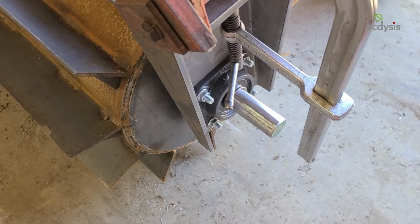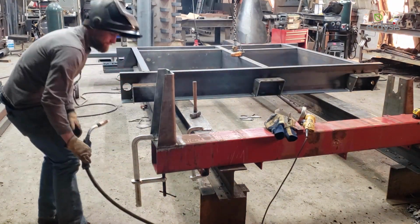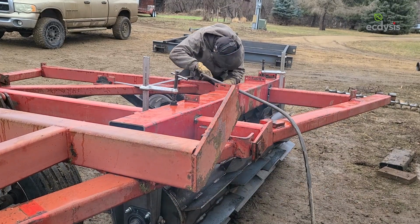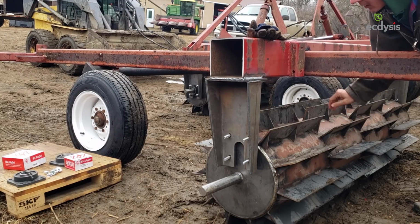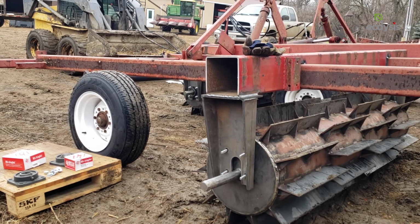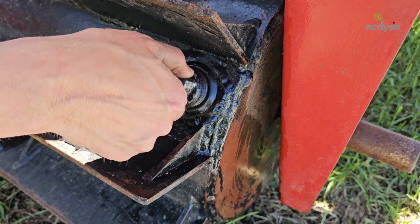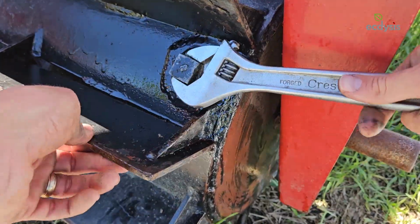We did one final check that the bracket and drum did not interfere with the arch of the road tires by clamping the bracket to the toolbar and taping the cardboard drum template to the bracket. If everything looks good, weld the brackets to the yoke, and the yoke into place onto the frame. The only thing left to do is maneuver the drums into the brackets and attach them to the brackets with bearings. This can be done in a similar fashion to how the center crimping drum was attached to the equipment frame. The last task is to add holes for filling the drums with water if extra weight is ever needed. This is accomplished by drilling a hole into each drum and threading each of these holes to accept a threaded water plug.